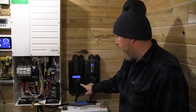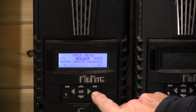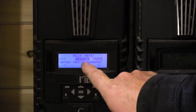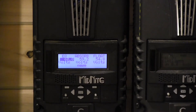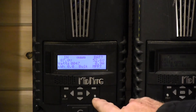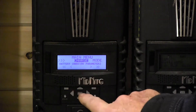We're going to have Sue zoom in so you can see the display and see what buttons I'm pushing. To get started, go into the main menu using the bottom right button on the Classic. Charge should come up highlighted — if it doesn't, just keep pressing the main menu button until it does — then press enter. The first menu we want to go into is Volts, and here we need to do a little math because the data sheet I have is in 12-volt.